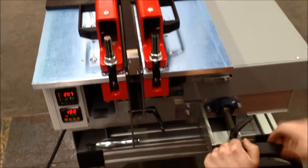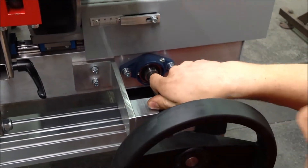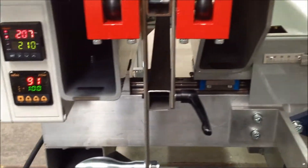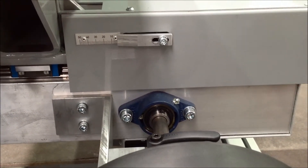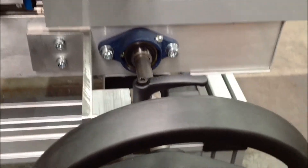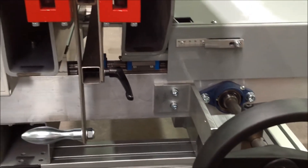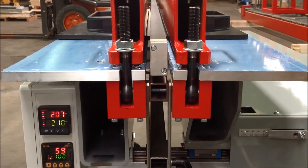We have now reached the 50 to 60 seconds. We are going down with the spring pressure, as you can see, and at the same time starting the countdown. Now we are heating the material for about 100 seconds, but with a lower welding force. The scale is now adjusted to only about 2 millimeters instead of 17 — that's about 10% of the original force. The wheel is locked at the 2 millimeter scale, and we are just heating the material all the way through for about 100 seconds.